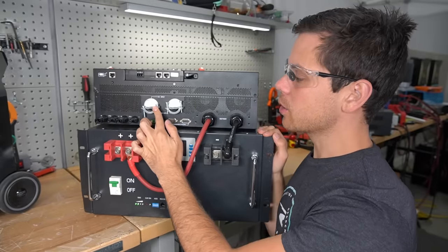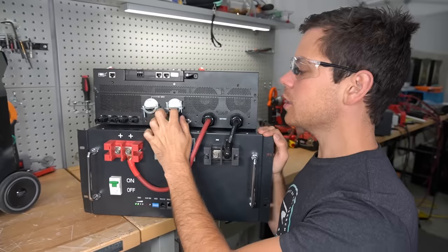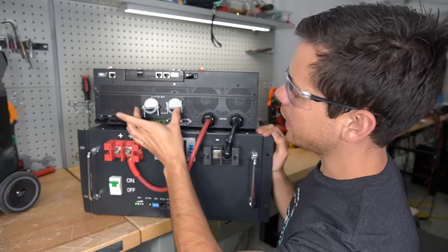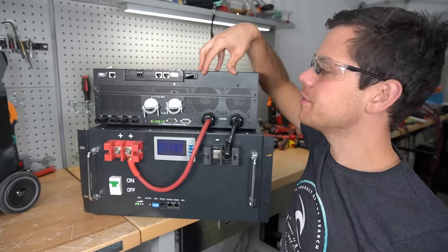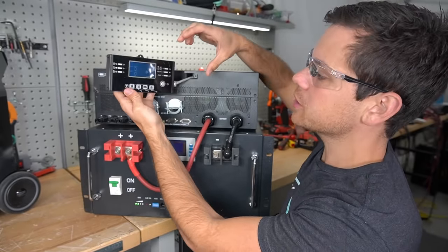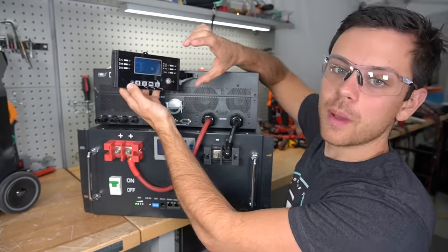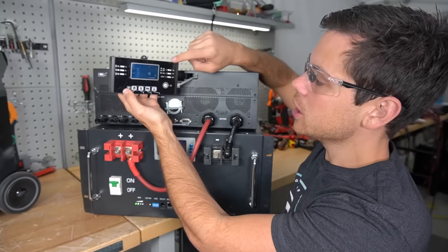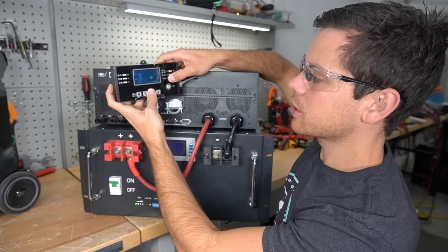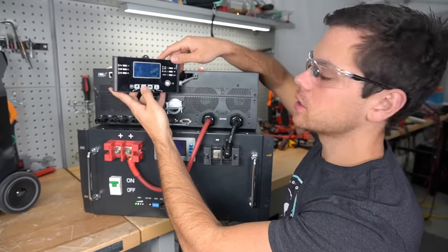For this you have two separate MPPTs and you plug it right into the box. The AC input connects right here with the terminal block and the AC output also connects right here with its own terminal block. You can use conduit, cable, or an extension cord if your loads are pretty small. The LV6548 also has a screen that you can remove and mount wherever you wish with an ethernet cable — this is how you turn it on or off. So if you want to mount this in the living area of an RV you can, then run an ethernet cable out to your system to change settings.